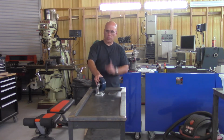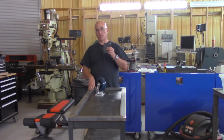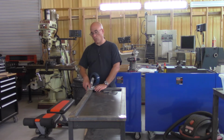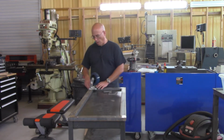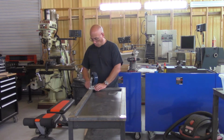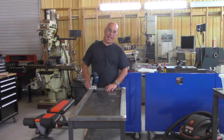Now, something else I wanted to show, the reason why I wanted to use one of these as opposed to bolting directly into the plate is that now I have access to the 4 holes, because as you can imagine, there would only be 3 screws mounted into here, and I guess that's enough, but it's better to have all of them. And anybody can argue, well, you could have just welded a square here, but then what's the point? That's basically what I'm doing, right? I'm welding a square and getting access to my 4 holes, and that's how we're going to tackle this.